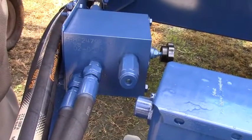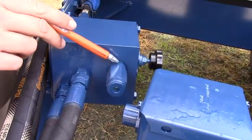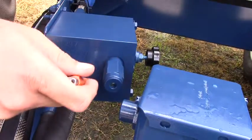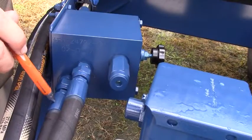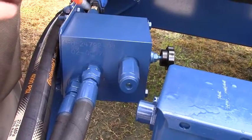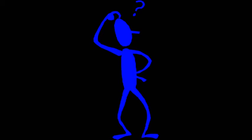Now we are looking at the front of the valve. We know it is the front of the valve because it has the pressure relief sticking out of it here. This top hose is P1, which you can see stamped on underneath here, and then T1 on this bottom line. So it's inversed from the back of the valve where the open and close handle is. Pressure on top, tank on bottom.